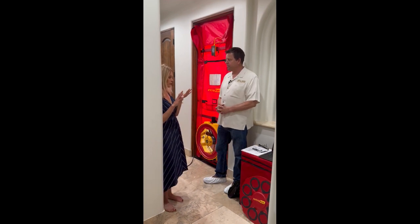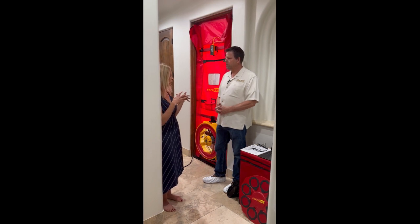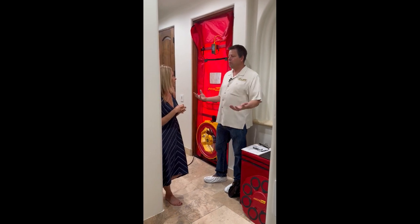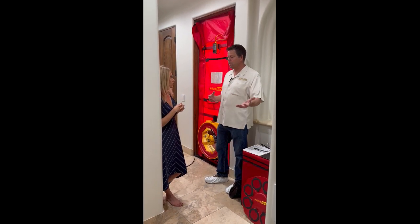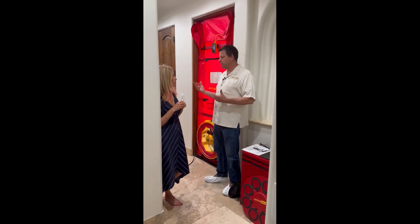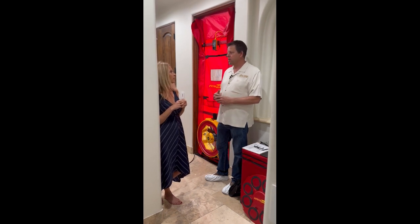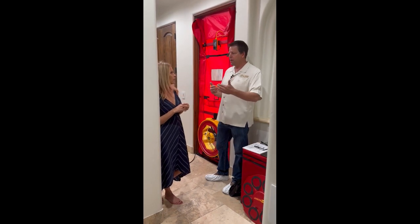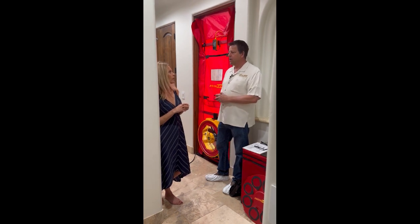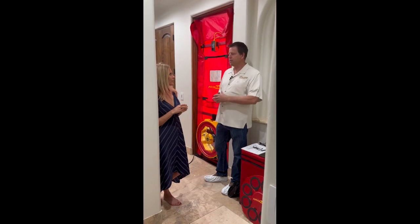Okay, so you're mostly looking for leakage to resolve those issues and make the home more airtight and energy efficient. Is that correct? It'll tell us the overall envelope leakage. It'll also show us where the leakage is. It's typically switches and outlets and windows and weather stripping, and people don't normally think of can lights, all those different things. We can feel where that infiltration is and make note to correct it. But as I've mentioned before, most of the infiltration usually comes from the attic space.